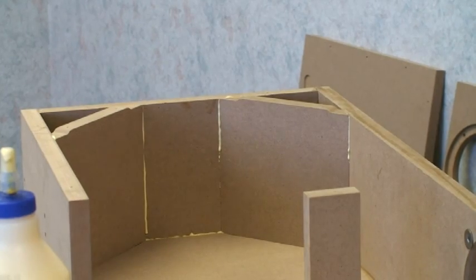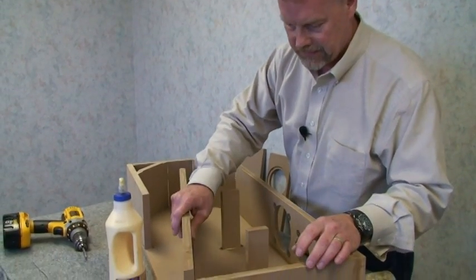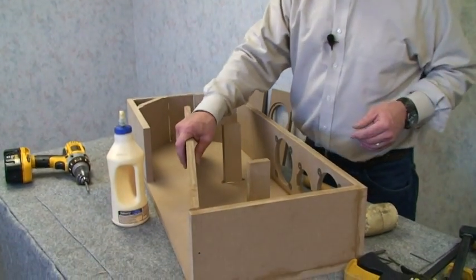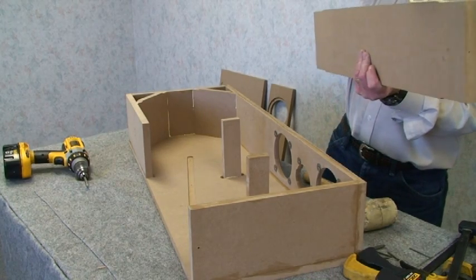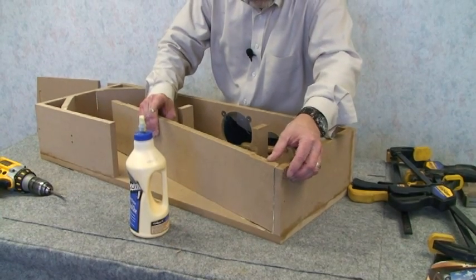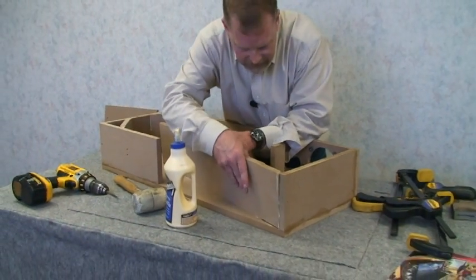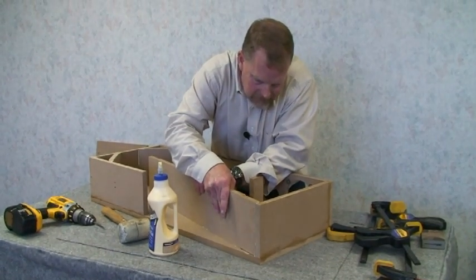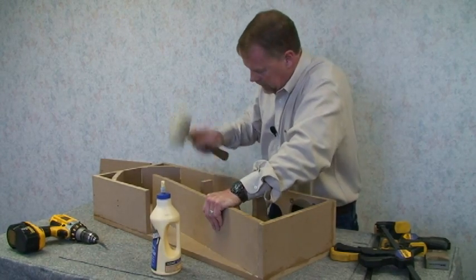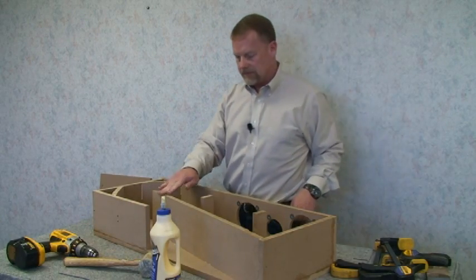This is the rest of the back. You can see it has a little bit of a bevel on it that matches the angle of the top. You want to take this and put it right there — it's a little bit harder to put in because you've got the long dado to press into, but go ahead and glue it. Start at one end and make sure you use a rubber mallet, because a wood hammer will really tear up the edge of the wood.